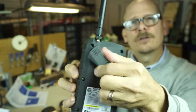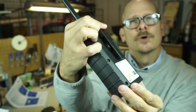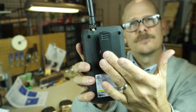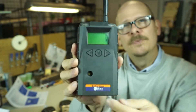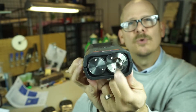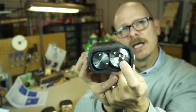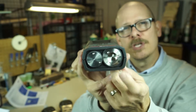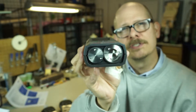On the back side you'll see a 360-degree turning alligator clip that can be attached to your jacket or your harness. You can also get magnets for these — you can use a limpet mine-type mount and put it on a beam or an area; it doesn't have to be handheld. It has a horn down here. On the bottom side you'll see two compartments: one is for a battery — these run on a 3.6V lithium dry cell, not rechargeable, yielding about two to three months of continuous use — and an auxiliary port for other options down the road.